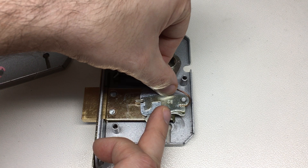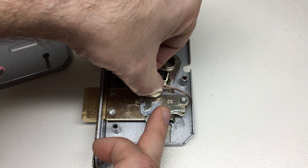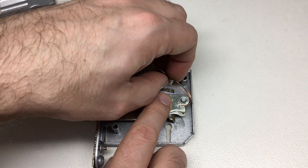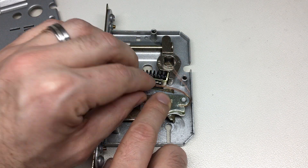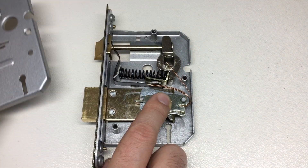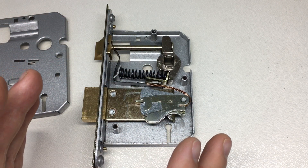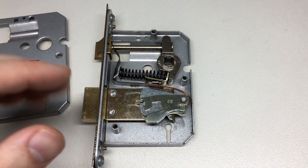What we want to do is maybe just have it coming about a couple of millimeters or so below the top, just so that these won't get caught in the window. We also don't want to go too far — you can see why it's important to have a cutaway — because these lever springs will just go everywhere. The actual casing itself that comes with the lock is just perfectly fitting and works best with these levers, so if you just cut a window in it's going to operate very much like a standard lock, as opposed to when you put the perspex on, which can sometimes compress the levers and make them act a bit weird.